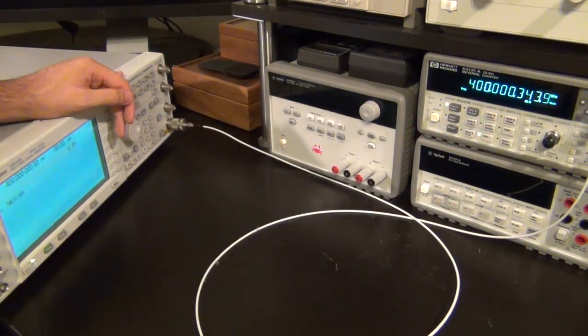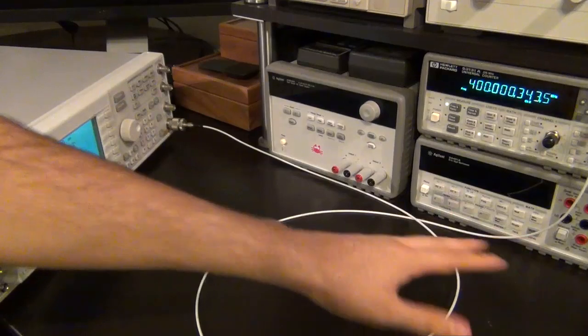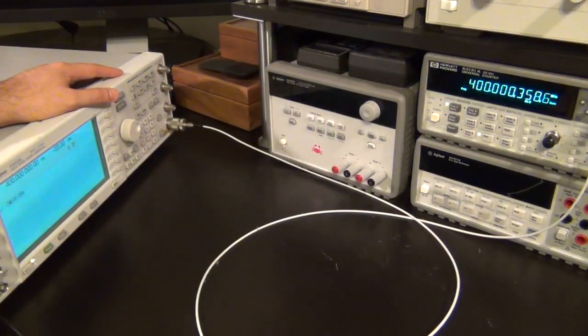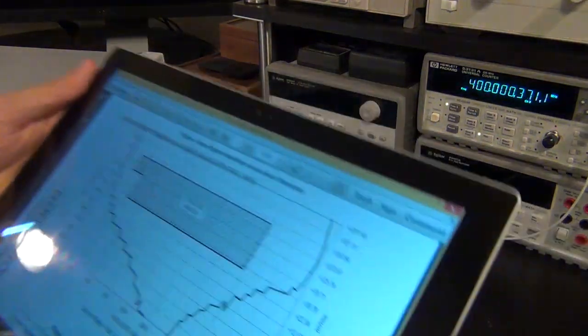But does this number actually make sense? So I'm putting in minus 55 dBm into the unit. Let's forget about the little bit of the losses of the cables, let's ignore that. And the gain of the amplifier chain is approximately 30 dB. So minus 55 dBm plus 30 dB amplifier gain becomes minus 25 dBm, which means that at the input of the divider, we are having minus 25 dBm, and that's right at the border when the divider no longer divides.